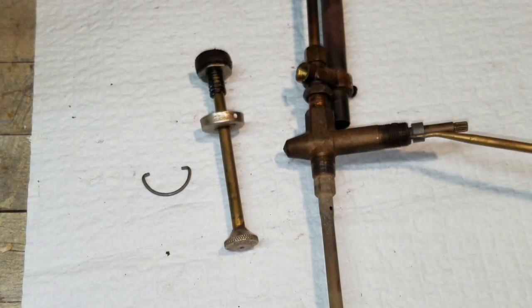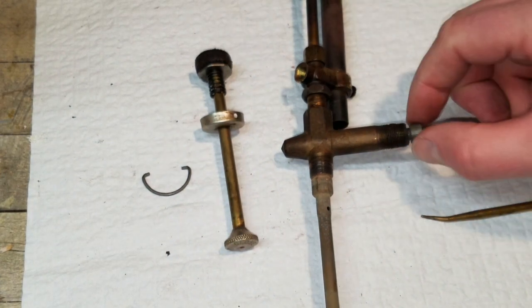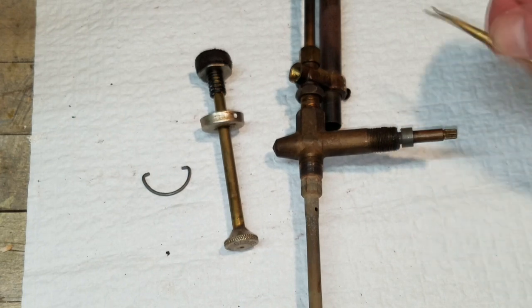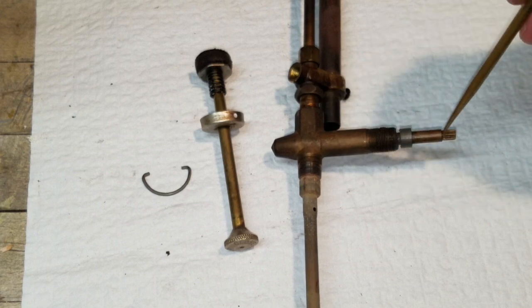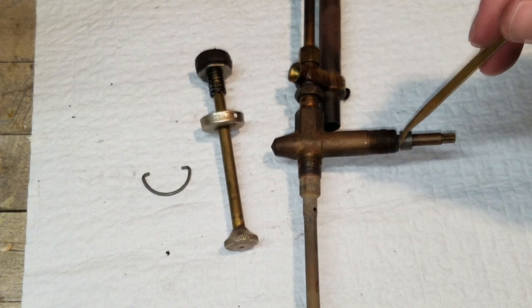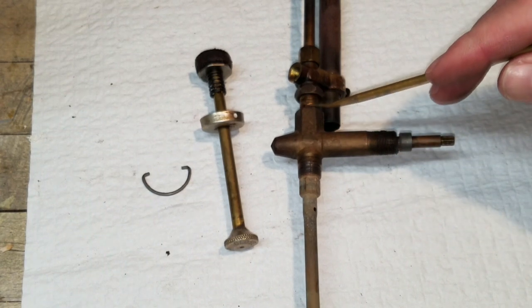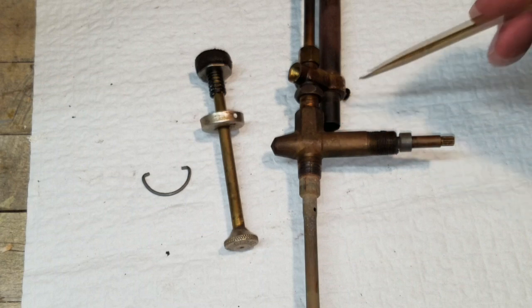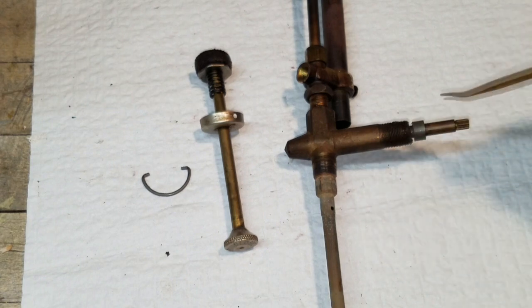The valve coming out of here could be rectified. There is a nut that goes on there, a B-nut type style. With the valve on, that might be a time you'd see fuel coming out around this area, or up in here if there's a leak there. Those are all things you can quickly check visually. Apply pressure to the tank, pump it all the way up so you've got a good amount of pressure in there. Take a good look at it, and use a flashlight to look inside, around the bezel area.